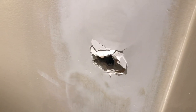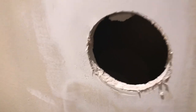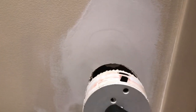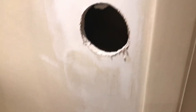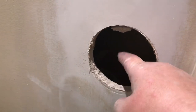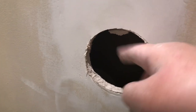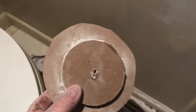So let's remove that and make a nice four-inch hole. Take your bit — I start it in reverse so it doesn't kick back on you, get it going, then put it forward and go slow. A lot of guys drop stuff back here — don't, because you have a pocket door with tracks and you just don't want to jam it up.